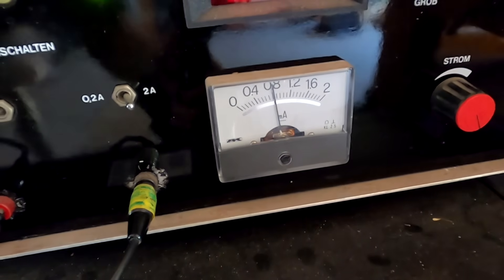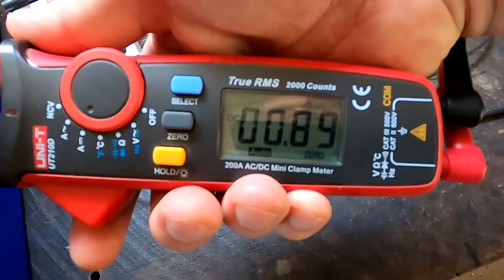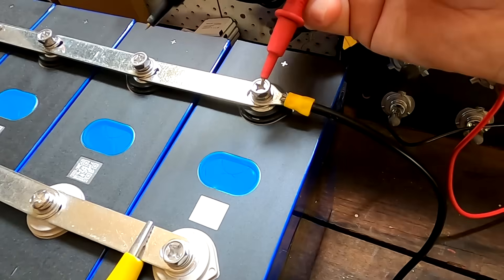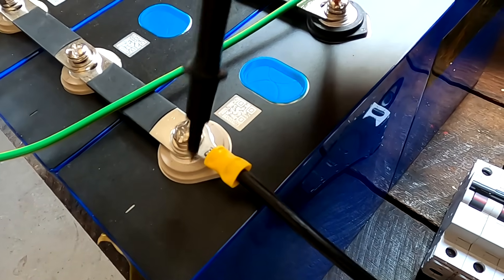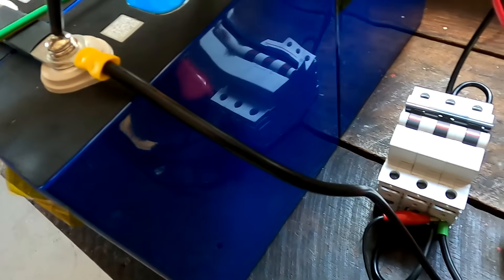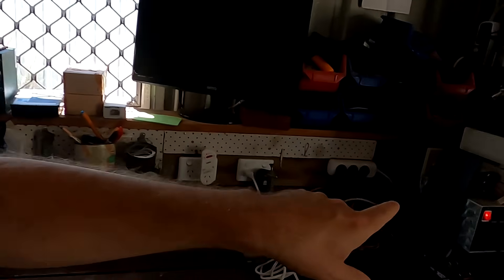We turn on the circuit breaker and check the workbench power supply — it shows 0.8 amps going into the battery. Measuring current at the battery confirms we are charging at 0.8 amps only. A safety check: red is positive, black is negative. We measure the voltage on one bank — 3.33 volts — and the same on the other bank — also 3.33 volts. This is a well-balanced pack, and the difference between the supply voltage of 3.6V and battery voltage of 3.3V is small, pushing only 0.8 amps.